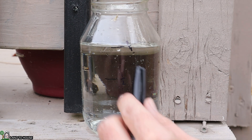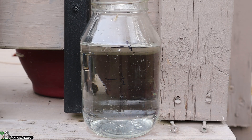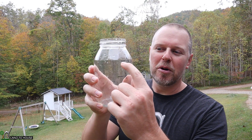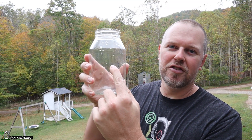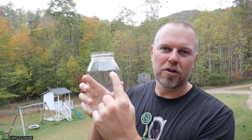We got some interesting results. It is the exact same value as the three-quarter inch waste valve right there at the top. Honestly, I was not sure what to expect with this test, so it's good to see some results. From what I'm seeing, the three-quarter inch gave us some great results — almost filled this jar in 30 seconds. The half inch was a little better than halfway on the jar. And then the one inch valve got us back up to the same point as the three-quarter. But the one inch waste valve has stopped again. It stopped flowing.